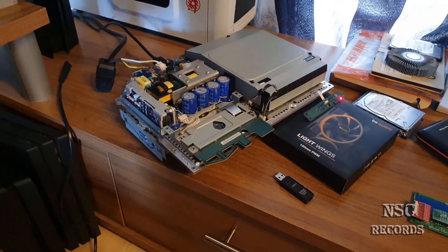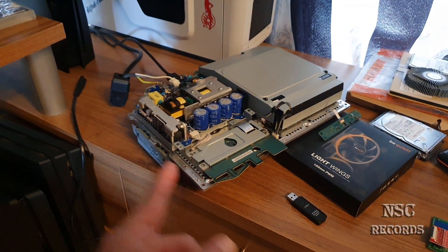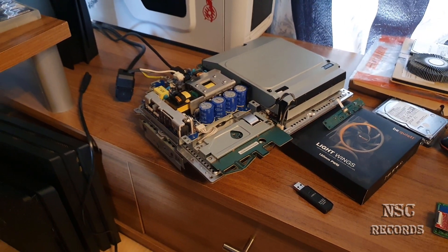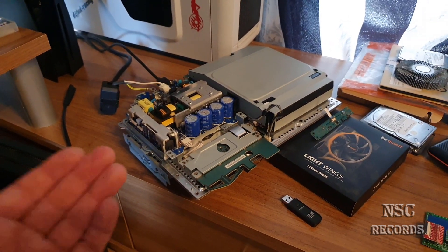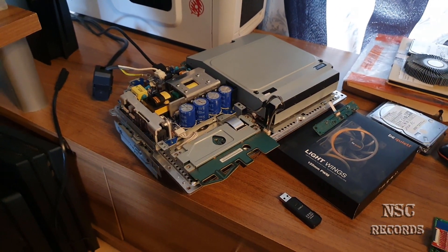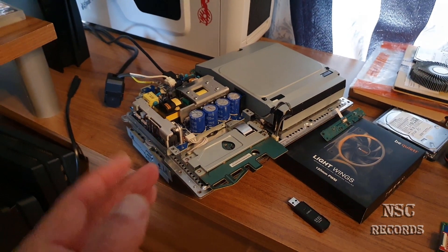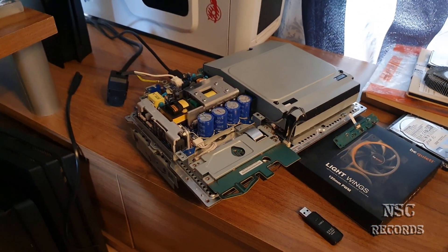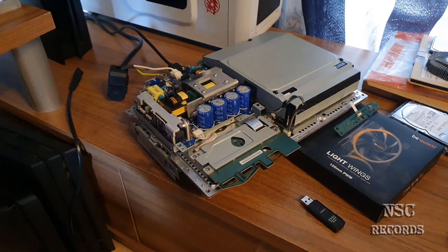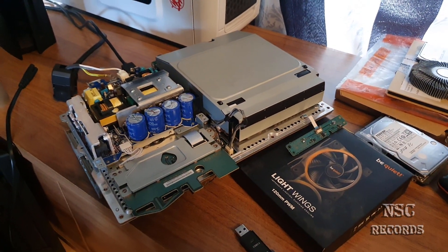Guys, I'm going to pull it all together and do it nice and clean, then I need to reinstall all the firmwares again. I can recommend: if you want to overclock your PlayStation, do a maximum of 600-750 MHz. In my eyes, custom firmware at 600-750 is just fine — you don't need anything else. It's a PlayStation 3, not a computer. You can use it 24/7 without problems. The higher overclock settings I tested made the PlayStation get a little hotter than standard/original. 800-950 MHz was just too much. Okay guys, see you soon — NSC in the place to be, peace!